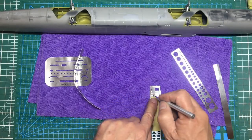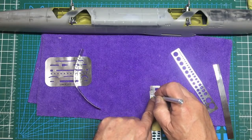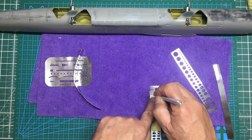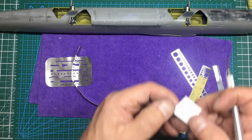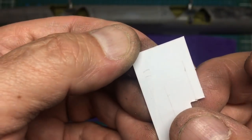And then what you can do then is just with your little pin, just go around. Don't put any pressure downwards. If you put pressure downwards, it will start to jump and skip about. So you just literally follow them around the edge, like so. I've gone way deep there, and you can see you end up with a scribed square on the surface.